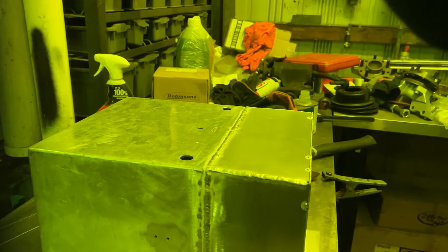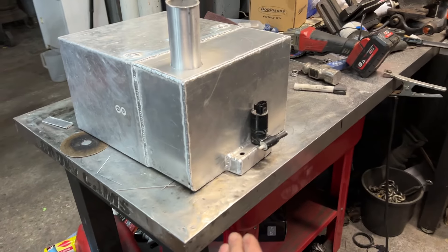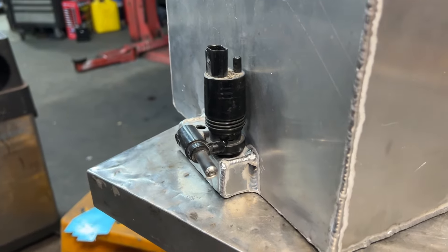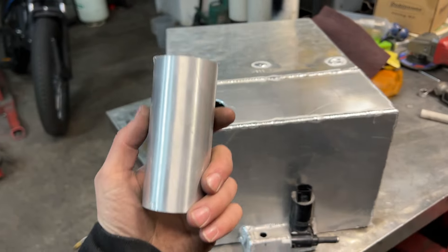Just slide the zip tie over the foam. Now I've got to weld these holes up — I've got these little circle pieces. If I tack that side first and then punch it in with a hammer, it should fit pretty perfect. That is the tank all done — almost. That's how we mount our motors. I'm pretty happy with that. I'm about to test this and see how much water it holds. That's going to be our filler neck — I'll weld that on and get a Raceworks cap that sits on that.